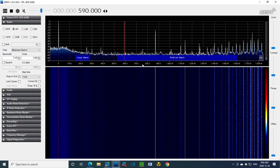See anything moving. I'm looking for anything happening here. Nothing. Okay, well, what if it's lower? If I hit the IF frequency, we should hear the signal generator straight through the IF. So I'm just going to go from 260 downwards. Listen very carefully. It's 240. 210. 180. 170. 130. Somebody, come on. Not a thing. Down to 95 and not a thing came out.